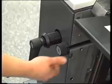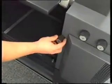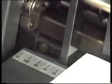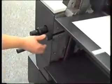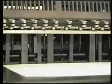Now, loosen the rotary knobs on the operator side and the drive side and slide the stops right up against the sheet using the bars. Do this first on the side with the side lay. Position the lateral pile guide rails so that they just contact the edges of the sheet. Do not move them in too far, otherwise the paper will be deformed. Now, lock both rotary knobs in position. Use the sleeves on the sheet separation blowers to match the blast air to the sheet format.